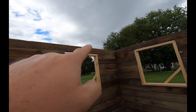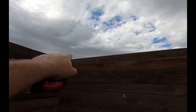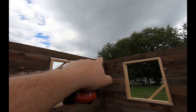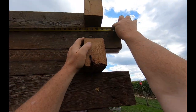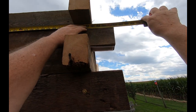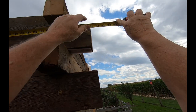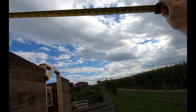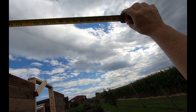We're working on the next course, which is also the first course where we start overhanging for the porch out front, and we start creating an overhang in the back for the roof. We've got about 13.1. I want to overhang the back 8 inches — that's 13.9. Then the front, for right now, 2 feet — that's 15.9.